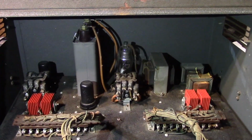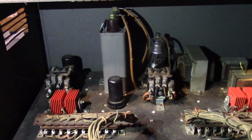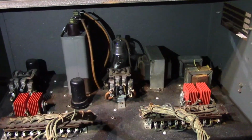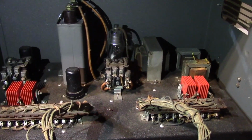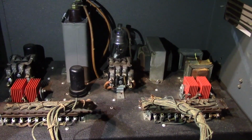I don't know that I would use some of those fancy exotic features like burning open the grid aperture, but at least for checking basic picture tubes. And the good thing for me is the vast majority of picture tubes I test are the kind that this was designed to test. Your standard 12-pin, 6.3 volt filament picture tube.